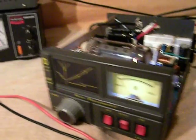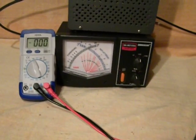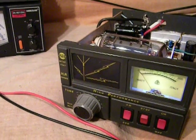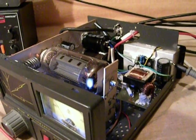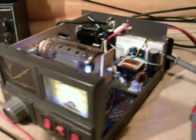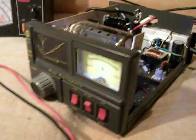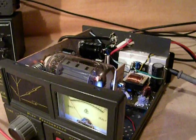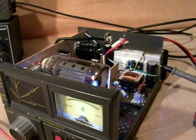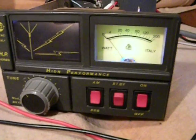In fact, it's regulated to 700 volts, so it will never go more than that, but it can still be adjusted. The tube is able to work even at 1 kilovolt. That's the last modification of my Zetagi BV-131 so that it can be powered from a standard 12-volt car power supply. Thank you for watching and 73.